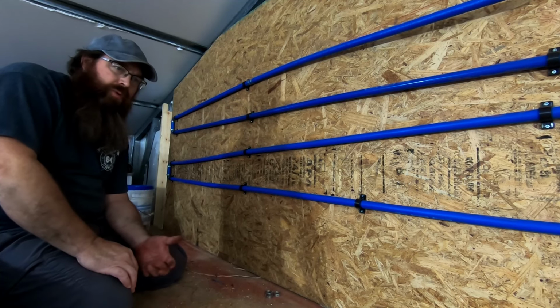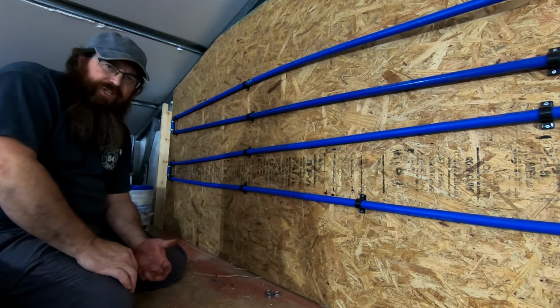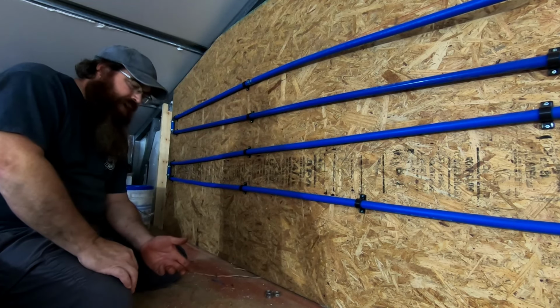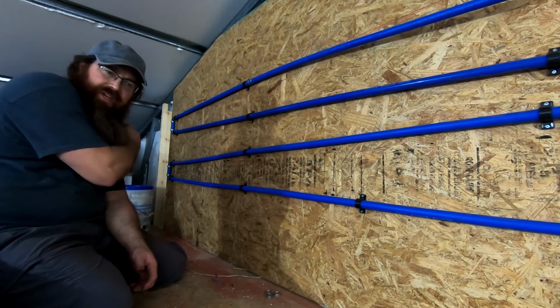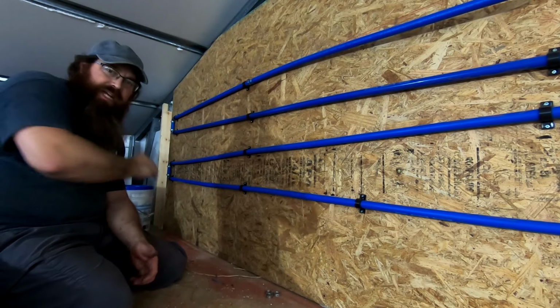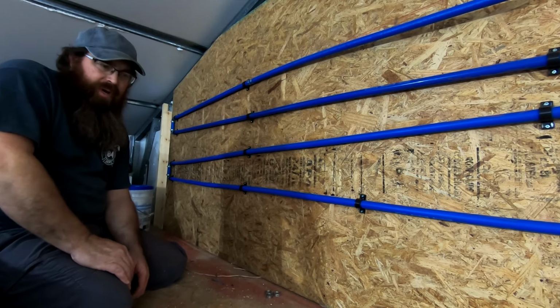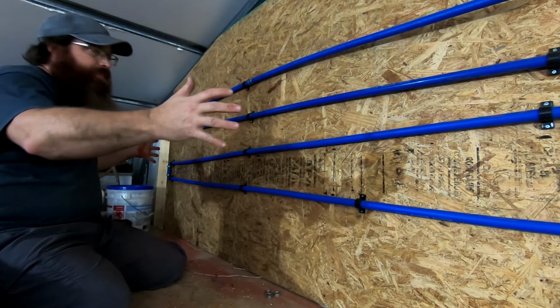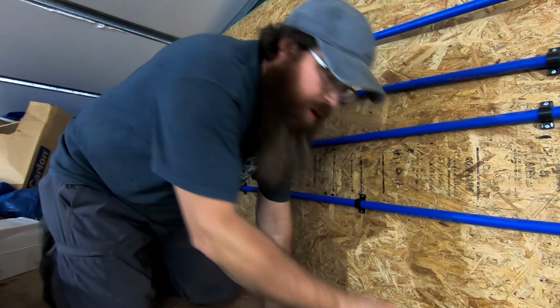In other words, if I'm down here working on a Monday and Tuesday, and I'm finishing up Tuesday afternoon, then I need to drain it off. If I'm getting ready to do painting or something to that extent, I'm gonna drain everything, let it build up, drain it again, and then build to have pressure back up so we can go forward with it. But guys, that is my water separation unit. I don't think we're gonna have a problem with water.